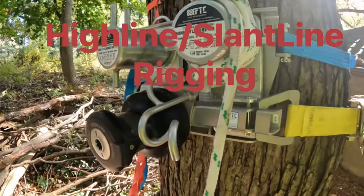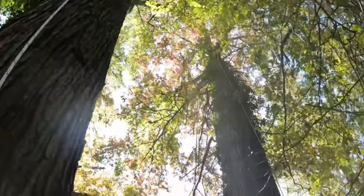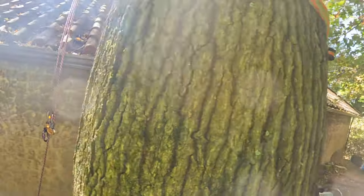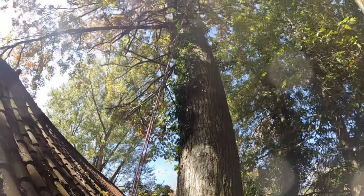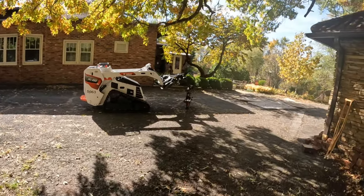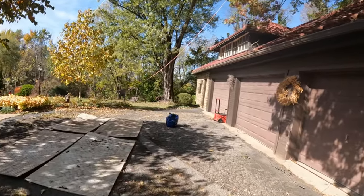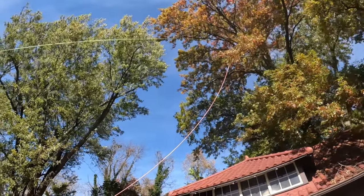The white rope is the main rope for our highline setup — we use the FTC transformer to tension it up. Here's the tree we're removing; the GRCS and the red rope going down to it will be the English reeve setup. This is a pin oak growing away from the woods line, completely out over the garage with a significant lean in that direction. The mini is about the biggest piece of equipment we can get anywhere near this tree, so we're using the highline to get stuff out into the open area.